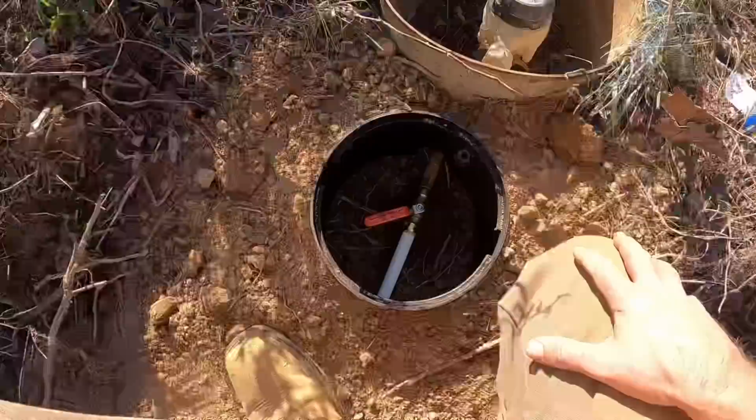Now then, I'm gonna go back up to the meter and turn the shutoff valve fully open and put all the pressure, street pressure, on the line and give it a few minutes and see what it looks like. Also, I'll see if the doors are locked or if there's a key and see if I can get water into the house, at least to a shutoff in there to pressurize that shutoff and pressure reducer, make sure it's not leaking. Get this one turned on now. That is fully on, full pressure going into the house.